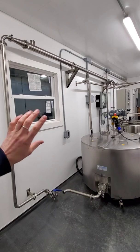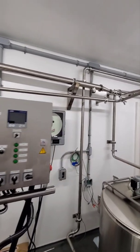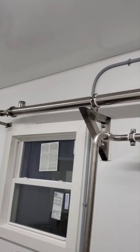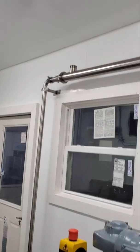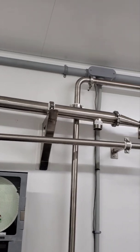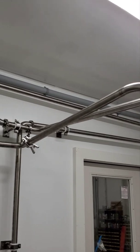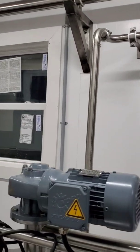What we do is run cold water — there's going to be a cold water tank somewhere else — and we actually bring it in through this little threaded line here, and then it's going to flood the cooler and come out the top. We send the product in the opposite direction of the water flow, and it cools the milk down.